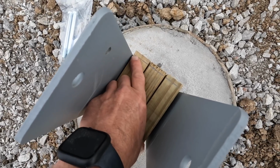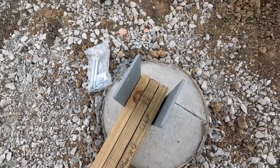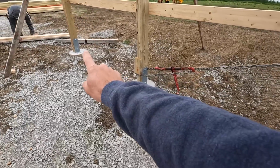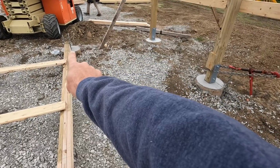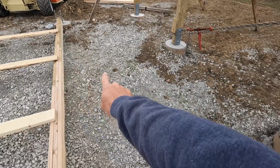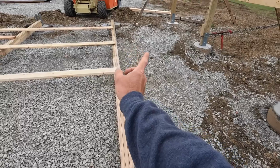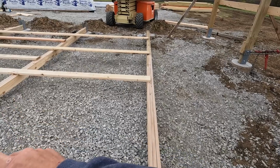And so I line all those up at the bottom, screw them in where I want them so they don't move. I know that my sidewall is all straight. So I'll start out, grab a measurement from the outside edge to outside edge, and I'll work that measurement up the side, matching it, so I know this is straight. Then I will do the same thing from the sidewall to the second one.